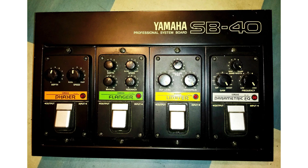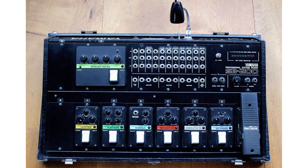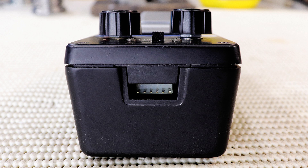There was the SB40, SB100, and the really remarkable looking SB200 — I've only ever seen these online in photographs. That brings me to the main difference between the Korg OCT-1 and this Yamaha OC-01, which is the DC connector. The Korg has pretty much a standard BOSS-style DC connector, whereas the Yamaha has a six-pin proprietary connector, and I assume that had something to do with the way it was hooked up on those SB pedal boards.